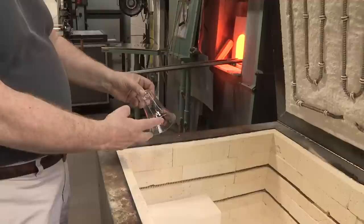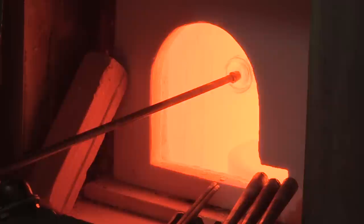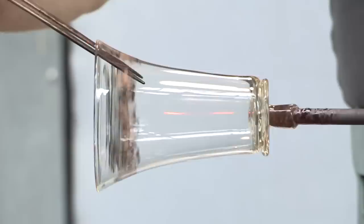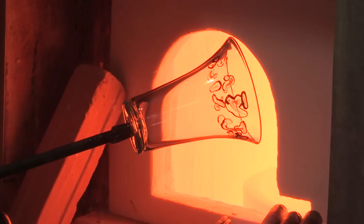The dried blank is placed in an oven and gradually heated to a temperature of about 950 degrees Fahrenheit. The punty or pontal is reattached to the bottom, and the firing takes place in the glass furnace. The reason for this is that the enamels fire at a much higher temperature than the softening point of the glass from which the blank was made. To fire the enamels, the blank actually has to become soft. The soft glass is slightly dilated. The entire beaker is flashed in the furnace for a last time, and the punty is broken free, and the beaker placed in an annealing oven for slow cooling.